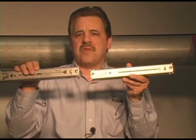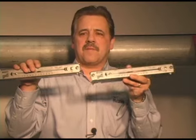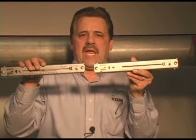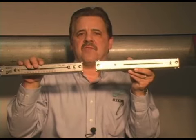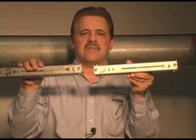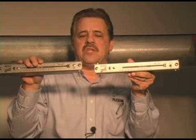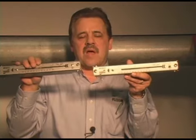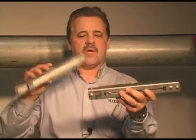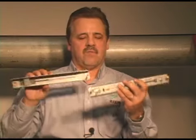There will be situations where with two sound paths, your signal strength might not be strong enough. This happens with difficult liquids, slurries, or old pipes that may have a lot of scaling buildup. When you look at your signal diagnostic, if you're not satisfied with the signal strength, typically a signal strength of 3 bars or greater, you may find that you change your mounting configuration to one sound path. Now, in one sound path, your transducers wind up on opposite sides of one another.